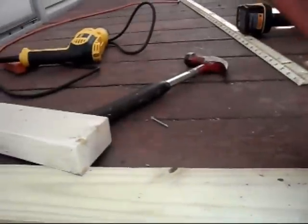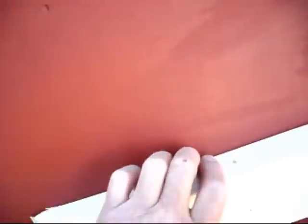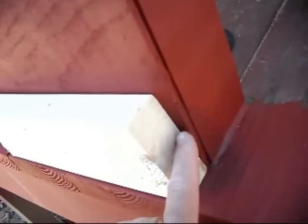So this will be a nailer here, but this is not a nailer here. This will be just like the bottom here. The nailer will take place with the piece that I'm going to be putting in on the edge. This is out about 1¼ inches. It's not rocket science. About 1¼ inches. So we'll take some stock. Hopefully I can get a piece 8 feet long, but I may not be able to without buying it. Like everything else, buy. And I'll 45 it.